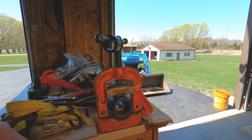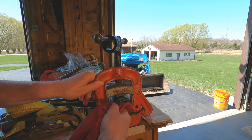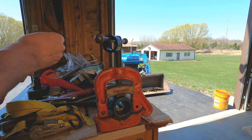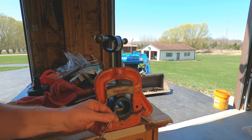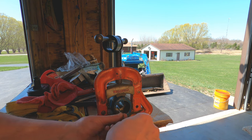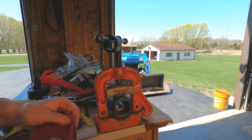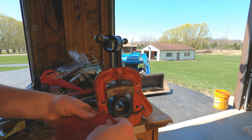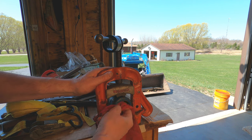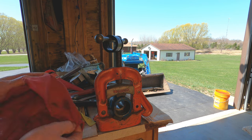There's no rust at all or anything like that in here since it's been completely immersed in oil its whole life. So I've just got to wipe it out. Maybe I'll take this little scribe with the 90 degree bend and just go through this snap ring groove to make sure there's nothing in there - and there isn't, just oil. Clean that out, and that's all clean, that's as clean as it's going to get.